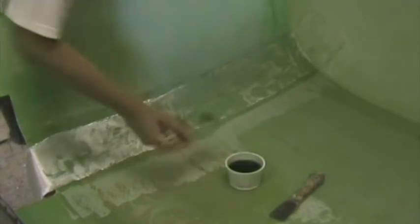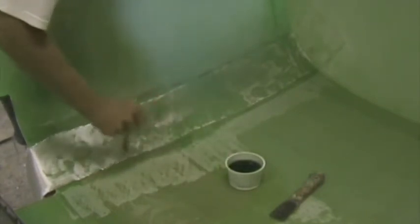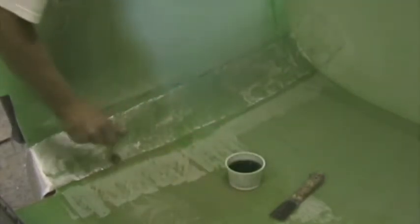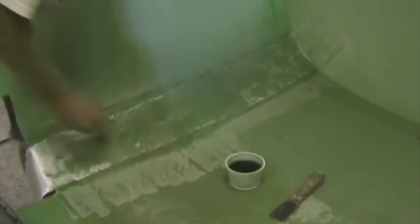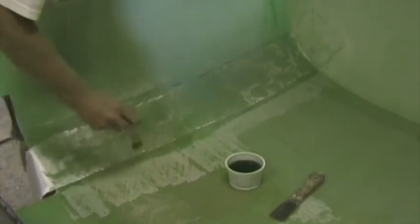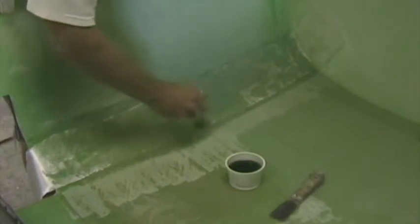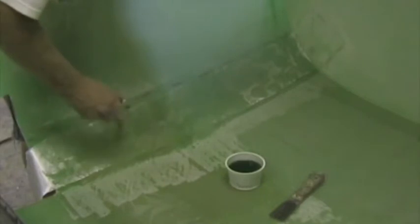By the time you've painted the entire area, you'll see that in fact it is wet in most places, and you can just go back and wet out the areas that are still dry. Notice how that area is becoming wet out. The ideal resin ratio is 50% by mass to the glass. This is difficult to achieve with a layup like this unless you are very careful.